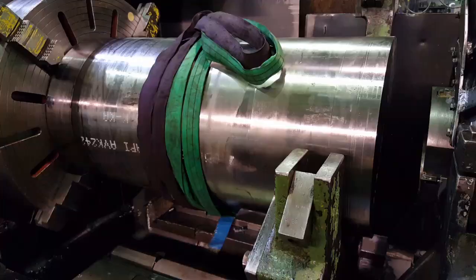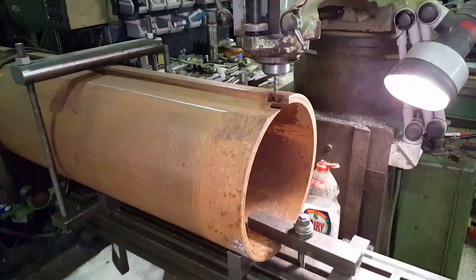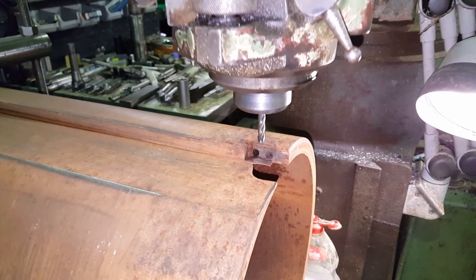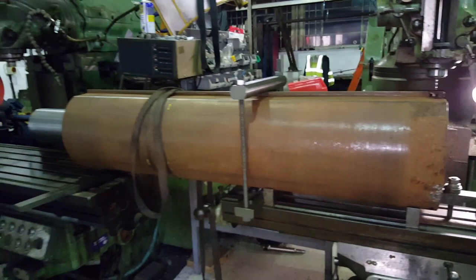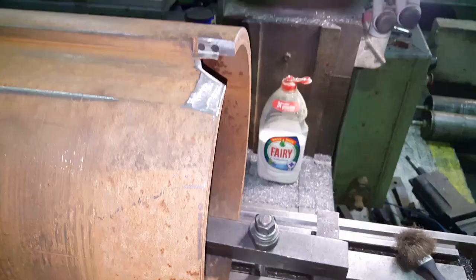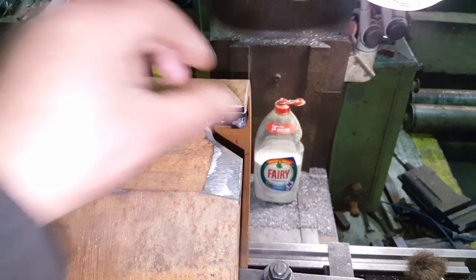Right, onto the Bridgeport. I'll turn this round first, do the other half while I'm milling the tool. Right, I'm ready to do a few alterations. I'm making the centre cartridge sit deeper inside — that's not deep enough. I don't even need the euro support table for this. So I've milled it 30 thou deeper. Ground this away to help the scrap exit the front end of the tool.